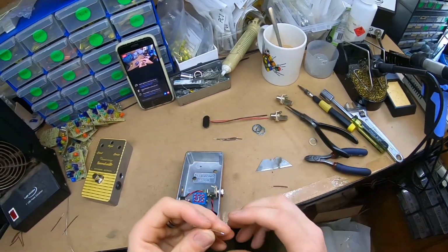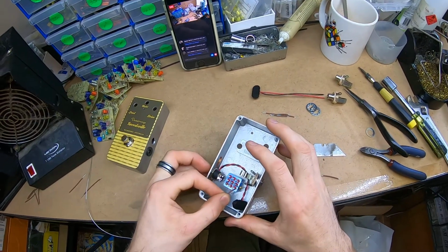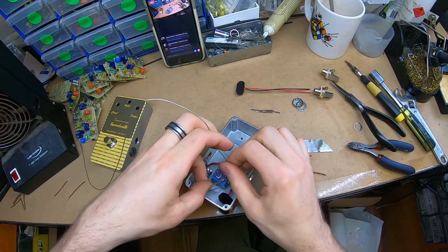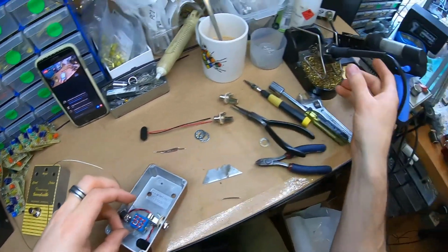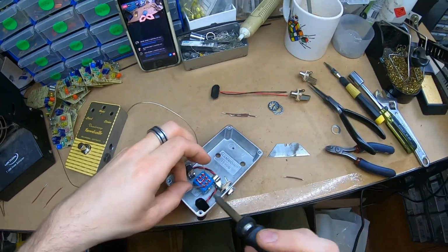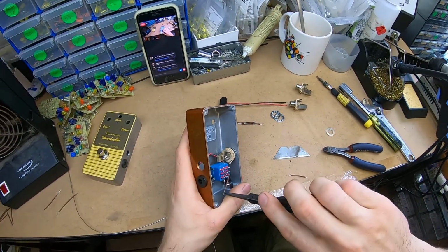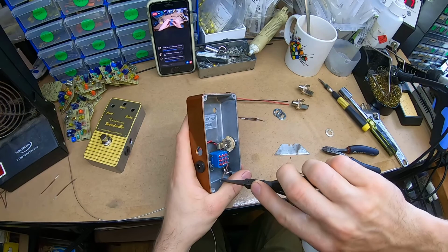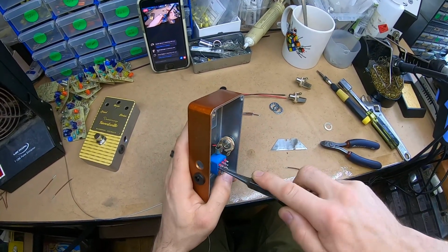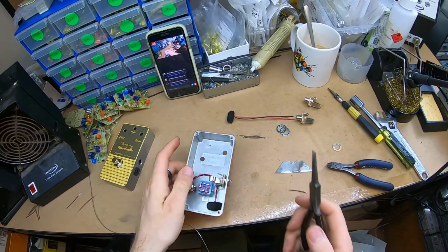So there's that link I was talking about. I'll put the shorter one in first because the longer one's going to share with another wire later. So if two things are sharing the terminal, I try and give them a little bit more insulation stripped off. Sorry, yeah, that's why I meant the shorter stripped. Take this, I'm pre-flipping my hand over, put a kink in it, push it up with my thumb. Yep.